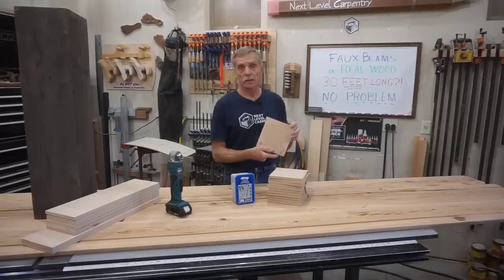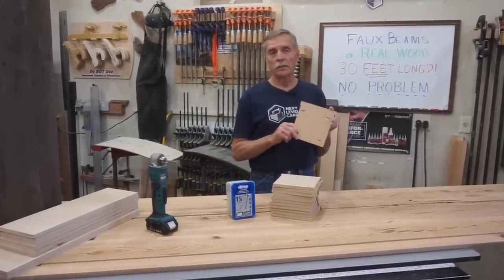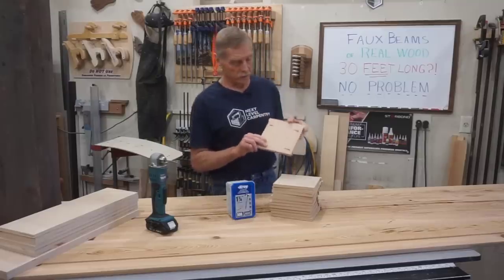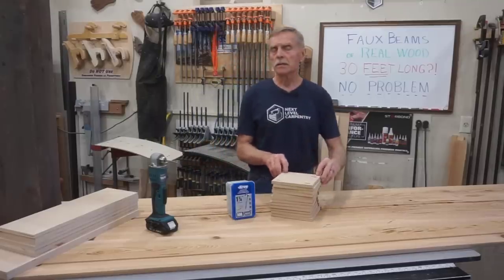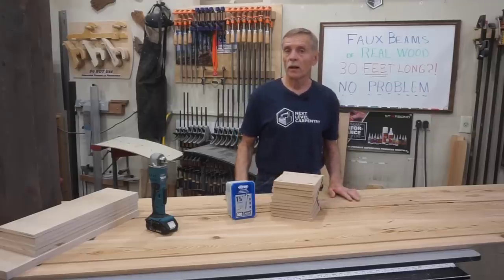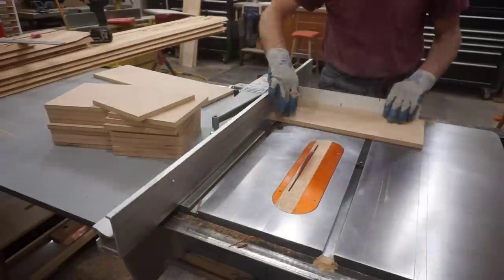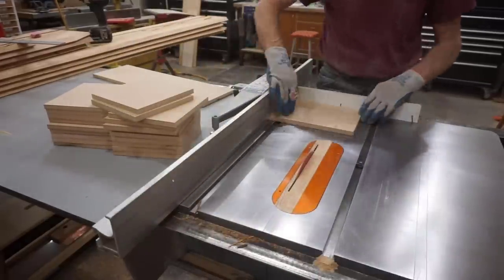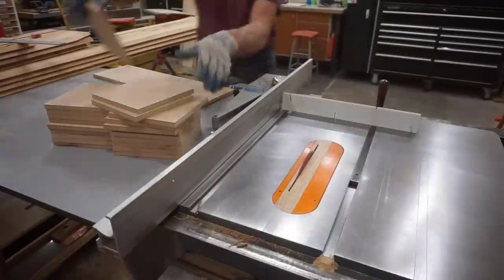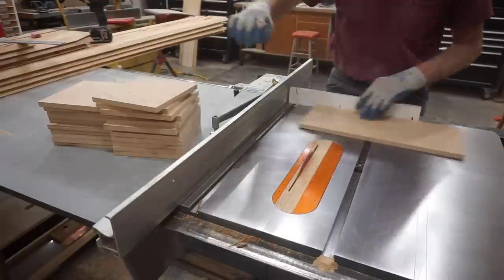Once I've gone through those gears to make these long pieces, I take a side step to make these special clamping and gluing blocks. So I'll show you the steps that I used to make these, because they need to be very accurate and consistent, but accuracy and consistency isn't too tough to get for making a stack of these blocks. I'm using 1/2 inch thick HDF material for these blocks. For these particular beams, I start by ripping strips 7 1/8 inches wide. Next, I cut pieces 7 1/16 inches long from those strips.